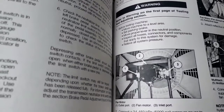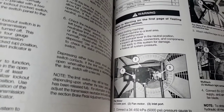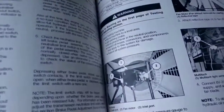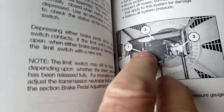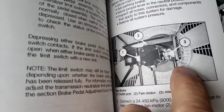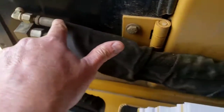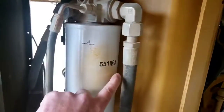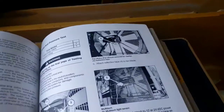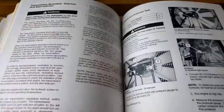For the fan speed and pressure test, they tell us to connect a 5,000 psi pressure gauge to inlet port 3 on the motor - we've done that here in a more convenient location. Then they tell you to plug the outlet port. What they're telling you to do is plug the outlet port of the fan motor and start the engine up, which will force all the oil over the relief valve. There's a return hose from the relief valve which runs back into the clean side of the filter. They tell you to do that and start the engine to see what pressure it goes to - they want to force that relief valve to open.